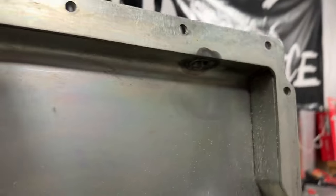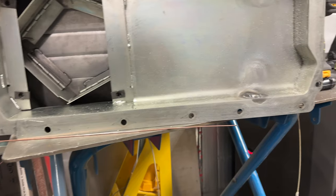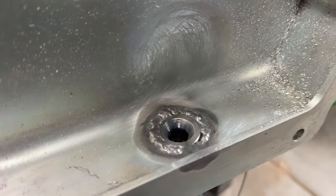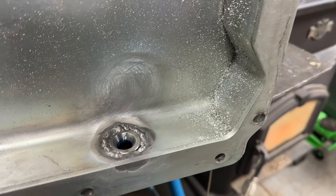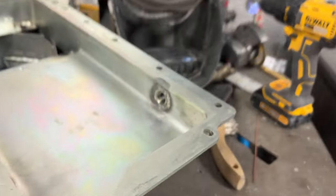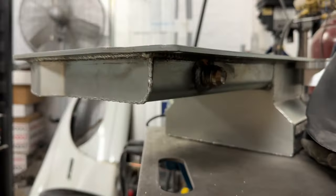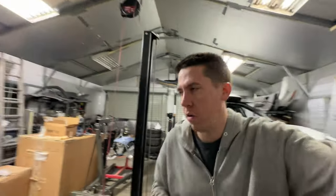Almost got them both done. I'm welding the insides now, just taking my time — it is still wanting to warp the flange just a little bit, so I had it clamped down on the table. Adding just a little more heat to weld the inside. You can see where it was ground and then tied in from welding the flange on the outside — a little double weld isn't going to hurt anything. There it is, inside and outside welded all the way around both fittings — twin turbos.